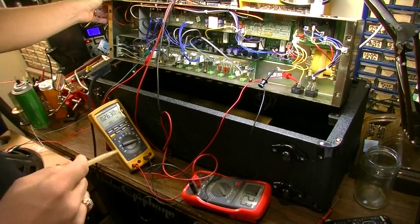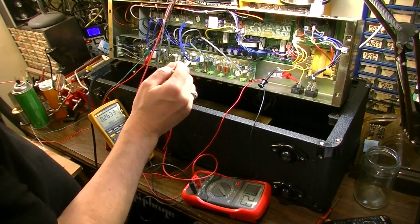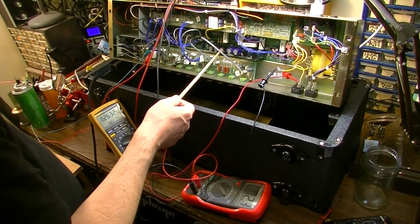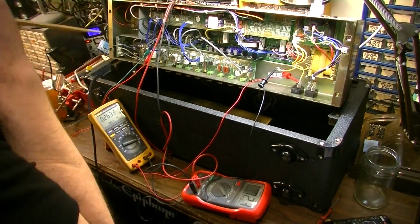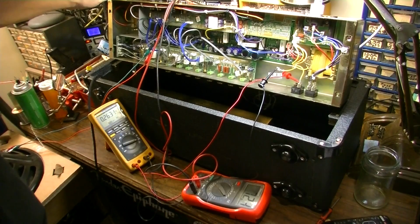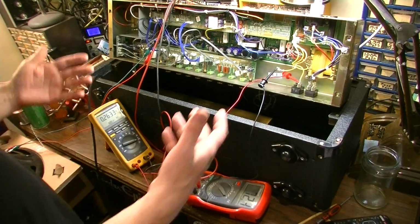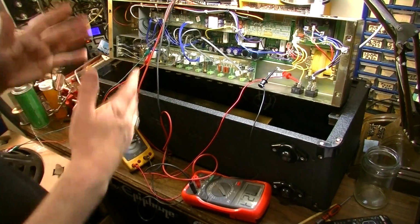The things on the high tension circuit that I did not check were things further down the stream. The 22 microfarad capacitor, well, all three of these capacitors that are feeding the preamp, but I have seen no spike above about 260 milliamps. So there's no dangerous current or anything like that going on here. As a matter of fact, I should be able to dial this thing on up to about 80, 85, somewhere in there, not even up to 90.